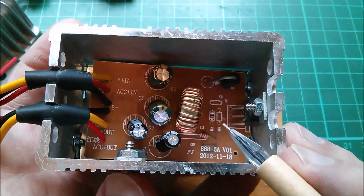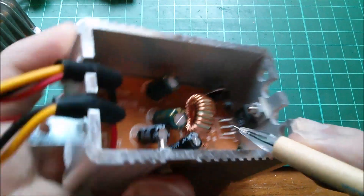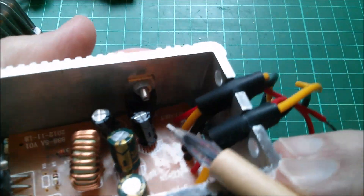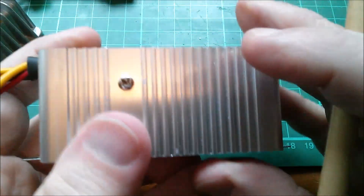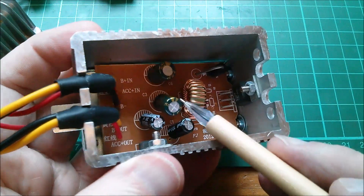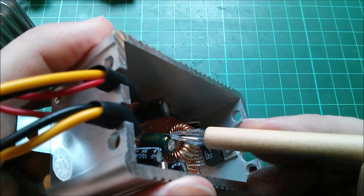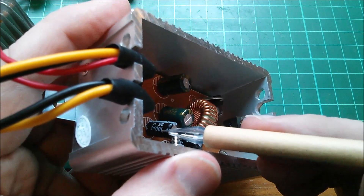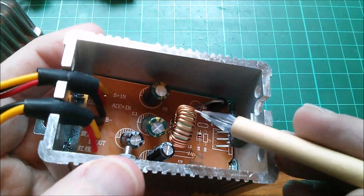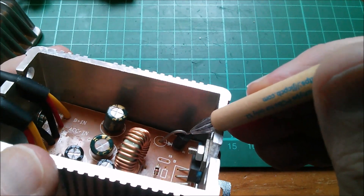There's really nothing in here. There's a five-pin device here - I'll get the number off that in a moment. There's another device here which is probably three pins. We've got a couple of electrolytic capacitors - these ones are 220 microfarads, and the black ones are 100 microfarads; I think everything's at 35 volts. There's a modest-size inductor here - is that really up to 30 amps? And there's also a diode, quite a chunky-looking one.